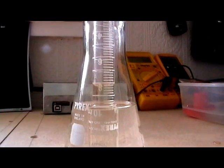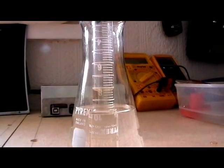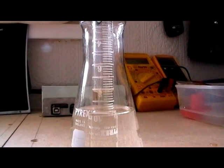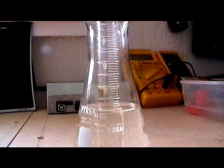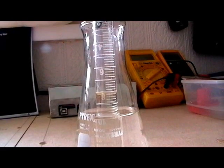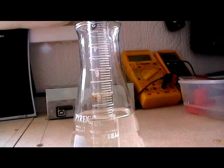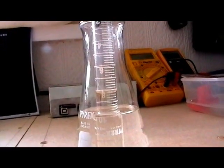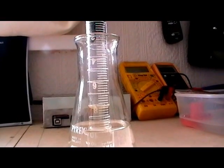I don't think you could get any cheaper than this. Anyone could do this for the cost of a couple of pounds, and that's why I thought if you were concerned about depleting oxygen levels, this would give you a good idea. It's only accurate to within a 2% graduated mark on this test tube, but I was thinking of modifying the tube so that it would give graduations in 0.1cc, which would give us an accuracy to 1%, and that would really be beneficial to monitor actual oxygen levels in the atmosphere.